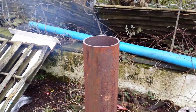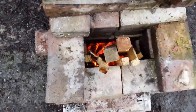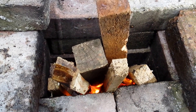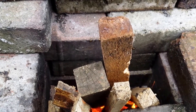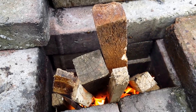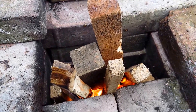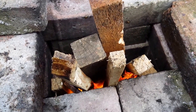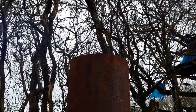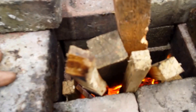What I found is that if the fire starts to die down and you've let it go for a bit without putting any wood in, if you lose the heat off it, it definitely smokes a hell of a lot more. Obviously the heat goes up into the combustion chamber into the exhaust and ultimately reburns all those soot particles. If that fire starts to die down in any way, you do see a lot more smoke, so you do need to keep it stoked up.